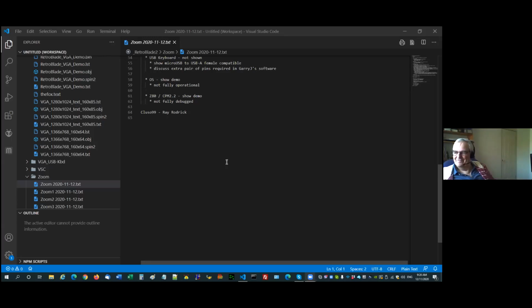Yep. And then do you think I'll need a little checkbox somewhere that just says, accommodate SD card? Or can both be handled seamlessly? Both should be able to be handled seamlessly, I would have thought, and certainly Eric does in Load P2, so he's got the right timeout in there. So I would have thought that maybe you're hitting it after reset with the identifier, the greater than space, whatever you do to determine the version.